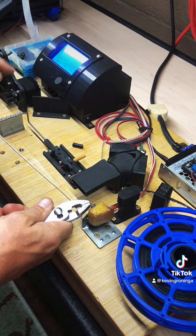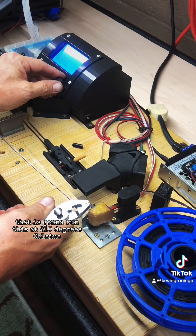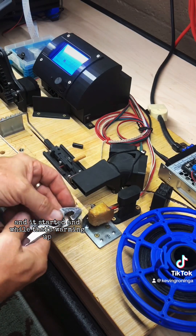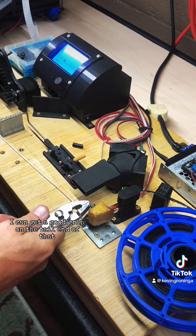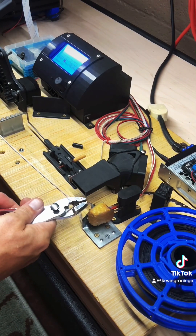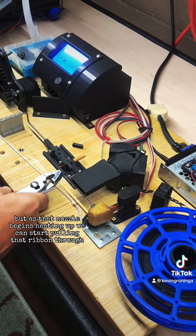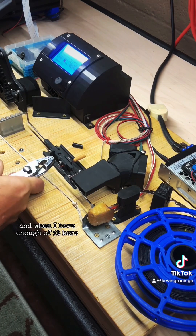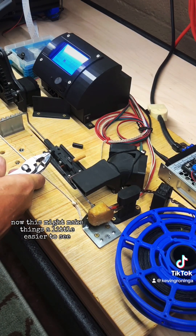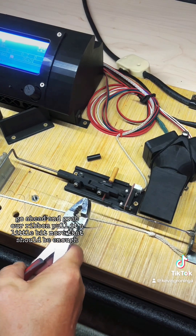This cover with silicone on it is just to keep me from burning myself — this can get awfully hot. I'm going to come over here and start up one of my G-Code files that is going to run this at 210 degrees Celsius. And while that's warming up, I can get a good grip on the tail end and very carefully start pulling some of that through. Be careful not to break off the thin end of that ribbon. But as that nozzle begins heating up, we can start pulling that ribbon through, and when I have enough of it, I can tie this off. It's gotten a little harder as I'm at the wider portion of the ribbon now.